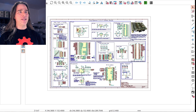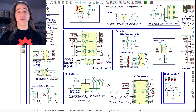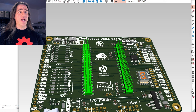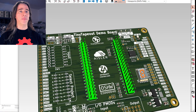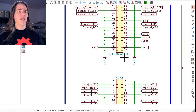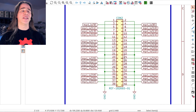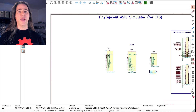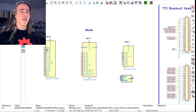Okay, let's do this. This is the TT3 demo board schematic — it's open hardware and online if you want a deeper look. The important thing is that it has this symbol for the breakout and routes a bunch of signals to and from it. The carrier has this form factor and we need to keep the shape roughly the same and make sure we map the pin headers and connections to the same spot. I've pasted in the carrier board pin headers — the naming's not great, Caravelle stuff, but I'm going to leave it as is for easy reference. I've also added the FPGA. We'll use the ICE40 UP5K in a 48 QFN. This is because the Lattice ICE40s are supported by a bunch of open source tools — no thanks to Lattice, they were reverse engineered. In the QFN 48, it's small enough to fit on the carrier and it has enough pins. Also, it's available. So first thing, let's give all this IO labels.